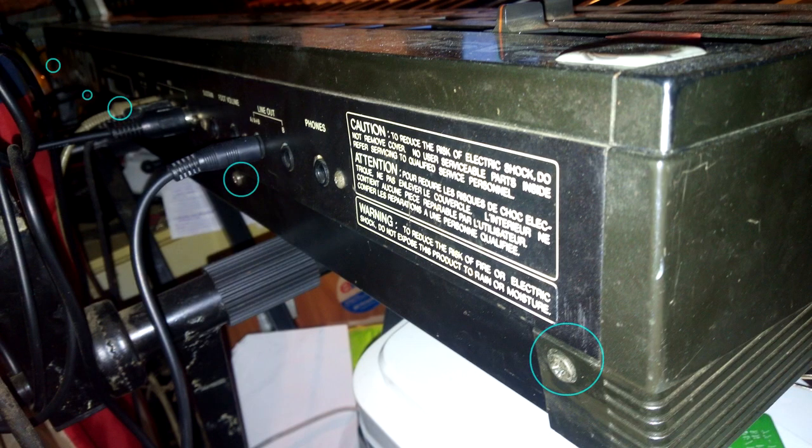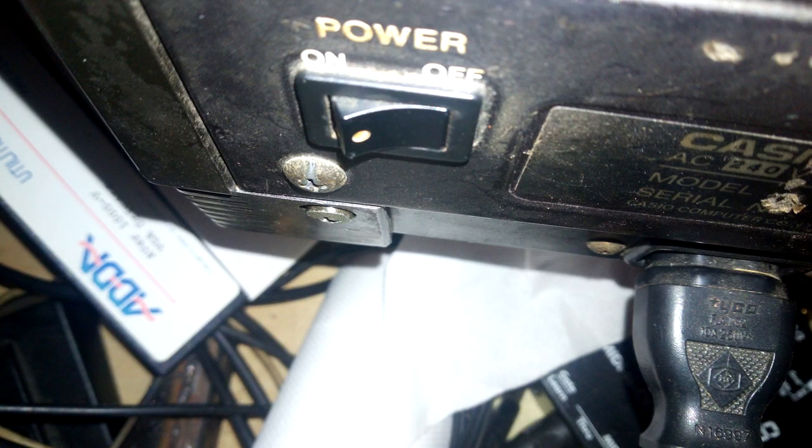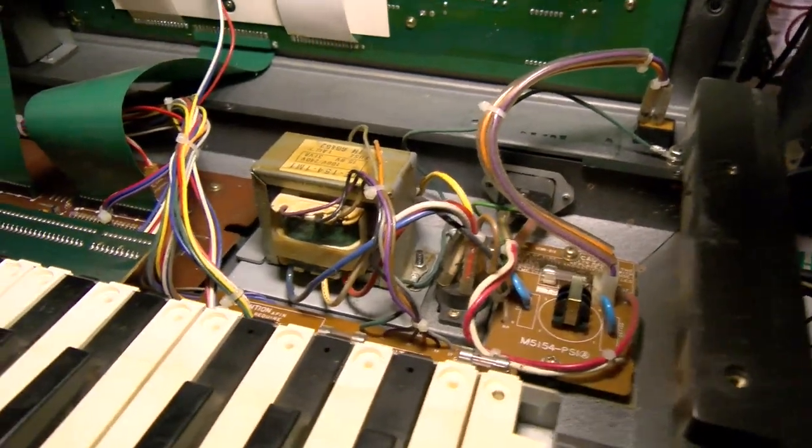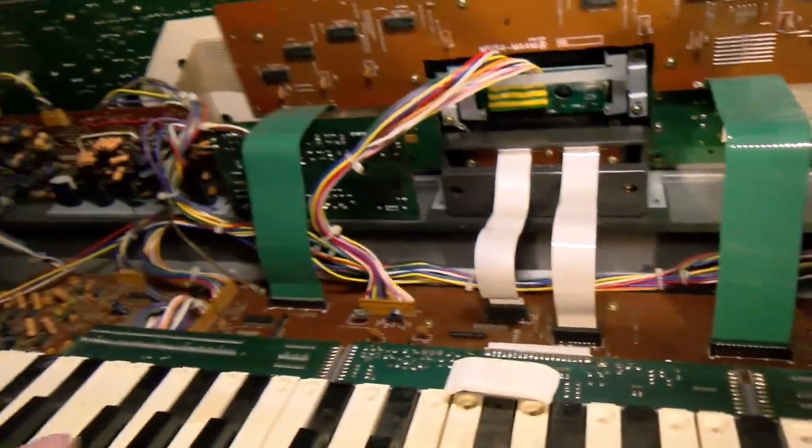To open the instrument, there's these five screws on the back, but not that one. That one holds a ground wire on. If you do turn it and you hear the nut fall off, it doesn't really matter. I suppose it's no big deal, as we're going in the instrument anyway, so you can just put it back on. Be wary that there is a star washer on it, though, and if that's disappeared, then you better get in there and fish it out wherever it's got to, because you don't want to short something out.